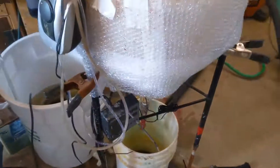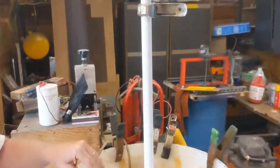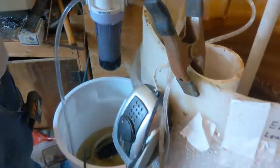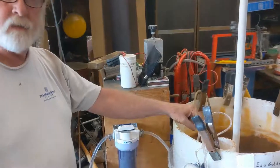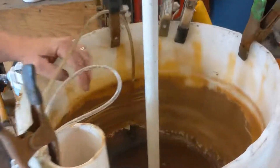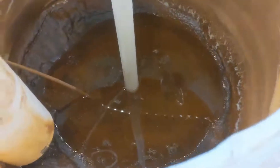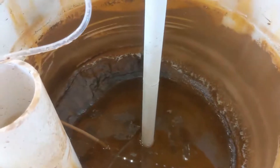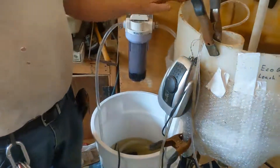We plugged the drain, lifted it up slightly, and we're allowing it to self-filter. This is a concentrate — ten to one, ten pounds of ore equals one pound of concentrate — and it's magnetic. It was separated with magnets, which will be a whole other video to show how that happened.